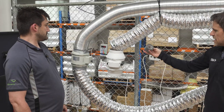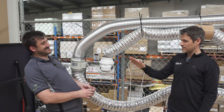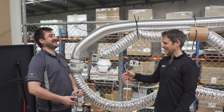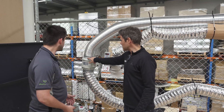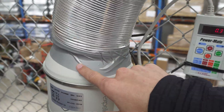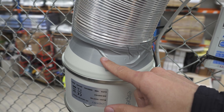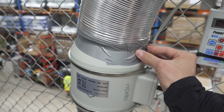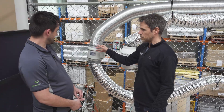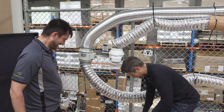This tape is most often what you see. So this is duct tape — wait, you call that duct tape? Yeah. Are you really going to use that on the duct? Oh no. We used it on here just to show you what not to do, and also because it's so easily removable. Give it a little bit of heat and a little bit of time and the adhesive and the plastic just gets weak, degrades, and melts. This tape often disconnects over time — the tape itself won't melt, but it just comes loose. The one thing you shouldn't use duct tape for is ducting.